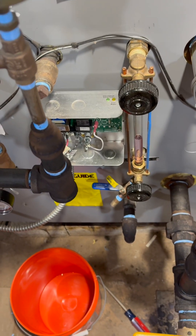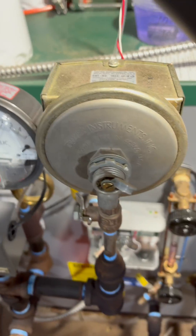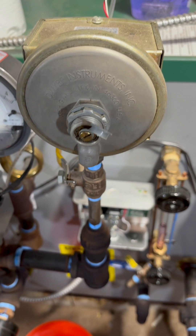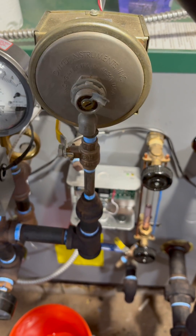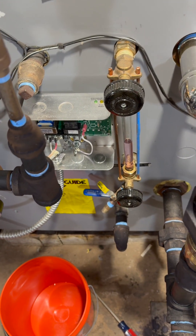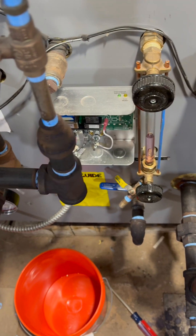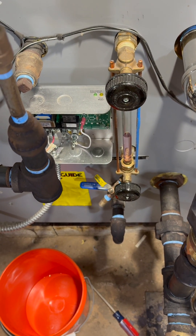I've got it calling for heat, but when I power back on my boiler, my timer kicks in for one cycle. With this low-pressure switch, when the boiler gets to about 5 inches of water column it fires off a timer relay, and the way it's made, when I apply power back to the boiler it has to go through one cycle of timing - that's why it's doing this. The important thing is the low water light is now out because I've re-added the water, the probe sees it, and now it's nice and clean for another five years or so before I probably take that off again.